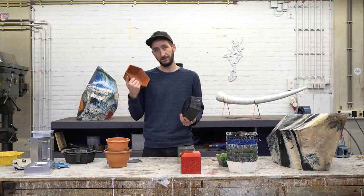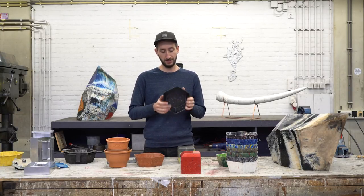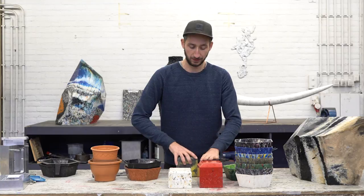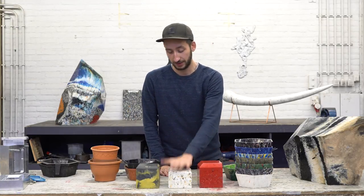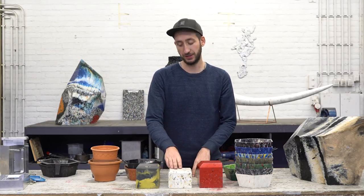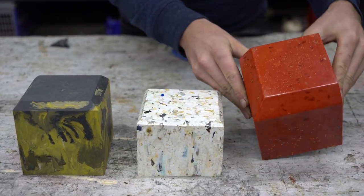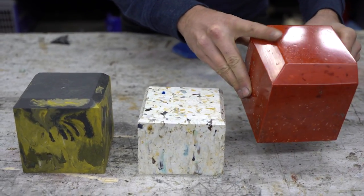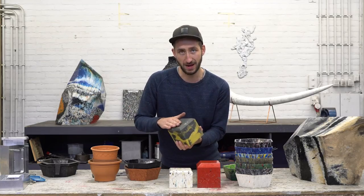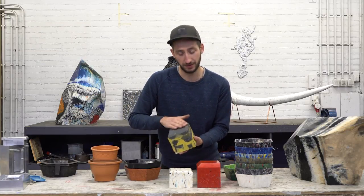The main difference when finishing these products is that the flexible one is softer and more difficult to really finish, polish, and sand. The hard one is really nice to sand and polish. As a few examples, we have three different blocks: this one is from ABS which is hard, this one from polystyrene, and this one from polypropylene which is soft. They all had the exact same sanding and finishing technique. But as you can see, the polystyrene is super shiny with super clean edges. The same goes for the ABS — it really has this polished finish. Whereas the polypropylene is way softer and way more matte. No matter how much you polish it, it just doesn't get as shiny, and it's so soft that if you put your nails in it you instantly see scratches.